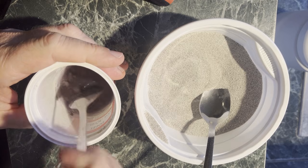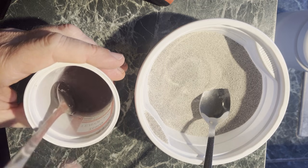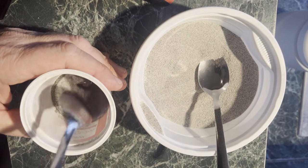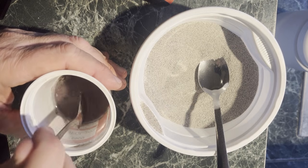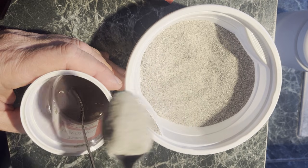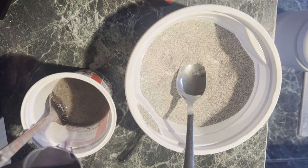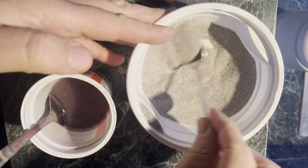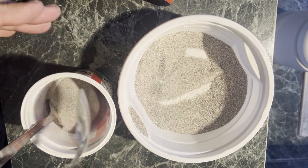That clumping is caused by sudden surface dehydration and gelling. Our job is to break up those clumps — if it were a large stone, we'd stomp them apart. It's crucial that all this is done below the surface of the liquid. That's the secret to producing a bubble-free stone, just like natural rock — working underwater forces the bubbles upward to escape. So all I do is spoon it in, then crush the clumps. I repeat this as long as I can work under the liquid level. Once I can't, I pour in more water glass and continue. I'm not mixing it at all — mixing bunches up the slaked lime, forming white lumps that separate out, and that ruins the whole act.